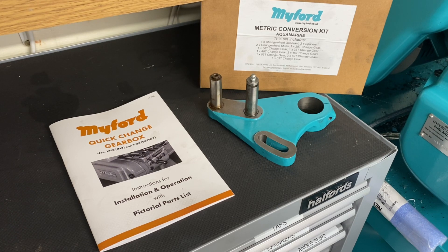An interesting point from Mark Gould was about the 33 and 34 teeth change wheel option, which I was intrigued by and haven't had a chance to look much into yet. If anybody has any pointers — and Mark, if you've got any data or links you're able to share — I'd definitely be interested. The point was that using the standard imperial gear set, that change wheel option gives quite a lot of versatility in conjunction with the quick change gearbox.